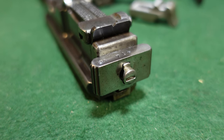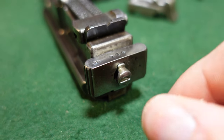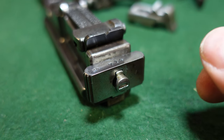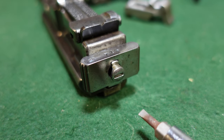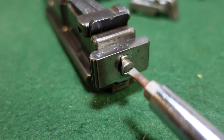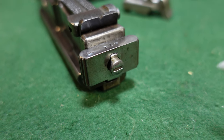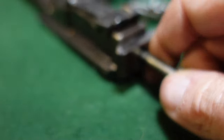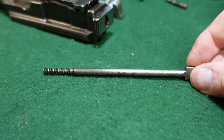What you do is take a screwdriver — if you want to risk it — and put it into this slot right here. When the gun is assembled, this would be turned vertically. Get it into the slot, apply pressure in to push the firing pin further into the gun, then turn it clockwise, I believe 90 degrees. Let off and your firing pin will protrude some, and you can then just pull it out. As you can see, a broom handle has an ungodly long firing pin.